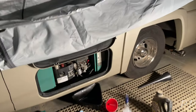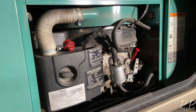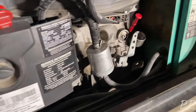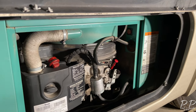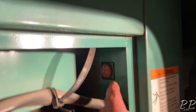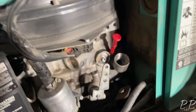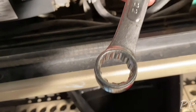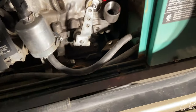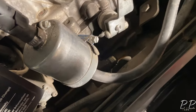Let's go through how to do an oil change on the Cummins Onan RV QD 3200. First thing I had to do was run the generator for about 15 minutes, then came over here and clicked off the fuse so it wouldn't start up. I took off the oil cap to relieve any suction, then used a 22mm wrench connected to the drain plug. I took it off completely after it was all warmed up and drained the oil into the pan.